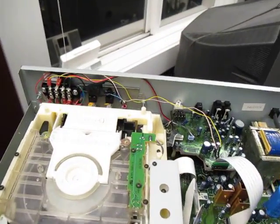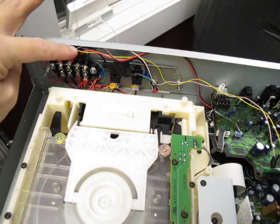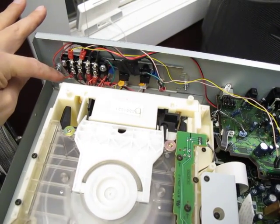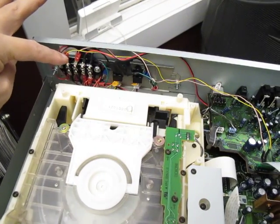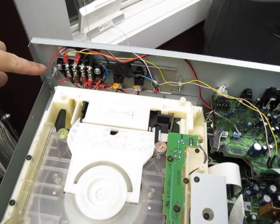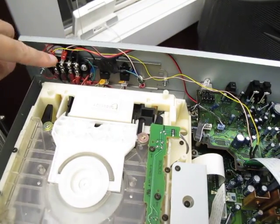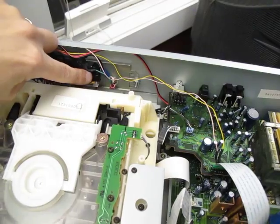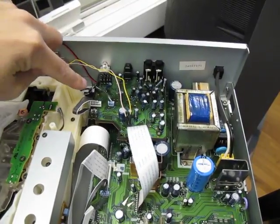If we have a closer look here at our distribution block, this is where I've got the SPDIF signals coming in. I've got power, plus 5 volt DC, and ground. Each of these is split up between the sources coming in on the upper row and going out to each of these connectors on the bottom row and wrapping around. So Toslink transmitter for the CD, Toslink transmitter for the mini disc, and power is being supplied from beneath the audio board.